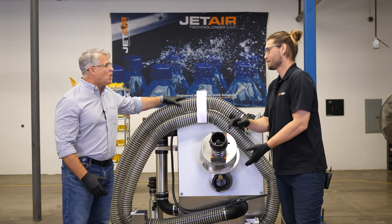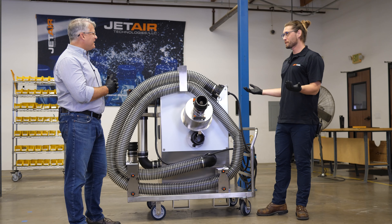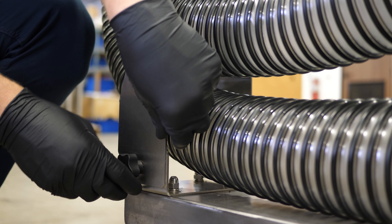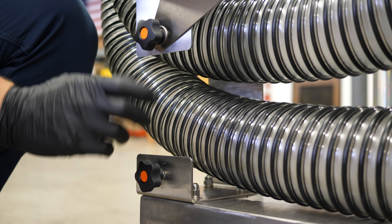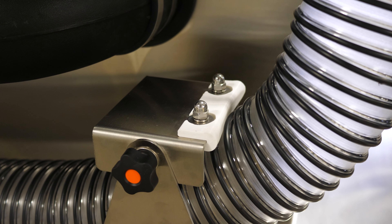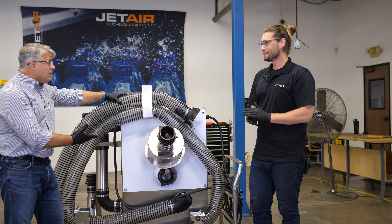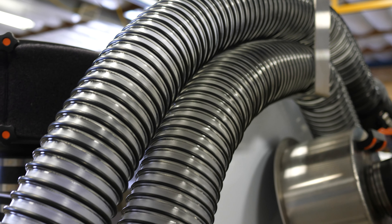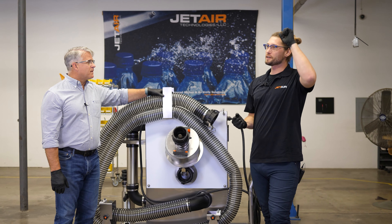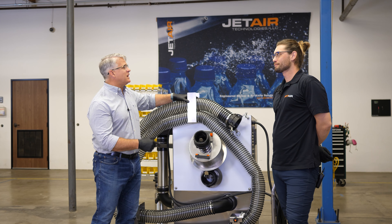There's a striped hose here — this is our smooth wall hose. We always want to ensure we're getting nice flow. The system has locks to keep the hose ready to go so it's not falling off the machine, and you can take it from blender to blender. It's 20 feet of hose, because with blender drying, the blender typically has to be at different angles to remove water. The hose takes care of all that travel as the blender is drying.